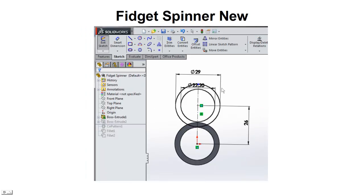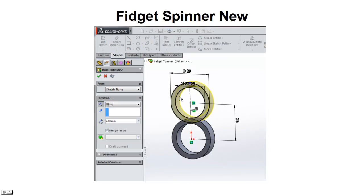Next we're going to draw one more circle at 22.2 millimeters and a second one at 29 millimeters. We're going to place those on a centerline drawn from the center of that first circle straight up. Make sure it's perpendicular, then draw that second circle and put a spacing of 26 millimeters between them. That'll make it overlap just enough so that the two become one when we print it. After extruding, we flip that to make sure it's inside the first circle and the two are merged together.